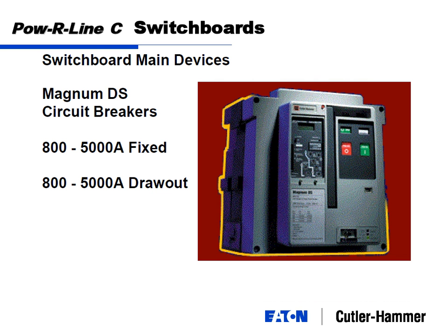And this is your air power circuit breaker, a little better picture. The air power circuit breakers, our version is the Magnum DS. That's our family there. And you can get those in fixed or draw-out mounted. So when I say fixed, you take a breaker, you put it in, you bolt it. The only way you can get the breaker out is to unbolt everything and pull it back out. Draw-out mounted is basically a giant cassette that you mount inside the switchboard. So you mount the cassette, and then there's rails, so the breaker itself slides in and out.